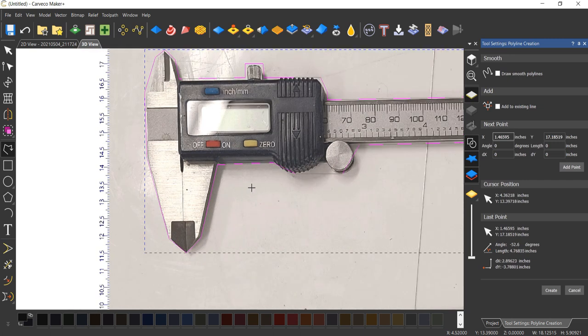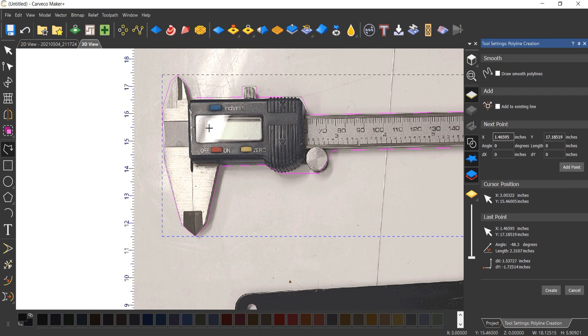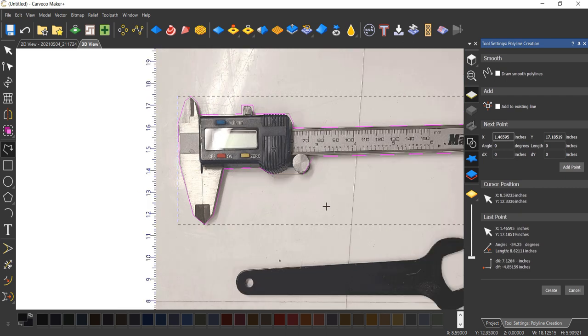What my plan is, when I cut these into the MDF, I will cut each shape out. I'll have my offset and I will test it in the machine after the cut. That way I can come back right away if I have to and make any tweaks while the bit's in the machine. If I need to just radius something, I can do that quickly, because by the time we're done, it'll just be doing an outline profile cut. So it'll be pretty simple.